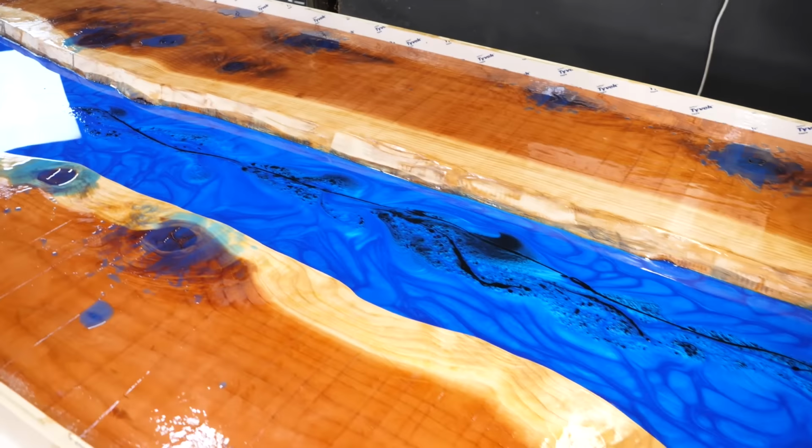The lint's going to leave little high spots and boogers on your top coat, and that's not what you want. Before mixing, give the Ultimate Top Coat a good shake in the bottle. If going with natural, the matting agents like to settle, so give it a good shake before you mix. You're looking for an even application when applying the product with your wet roller. Knock down any high points with one final pass, nice and even pressure, then switch over to a dry roller and use light pressure to remove the excess material.